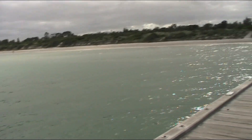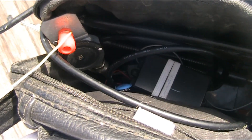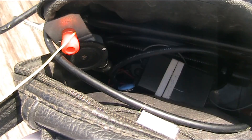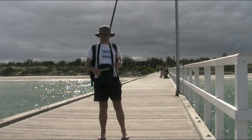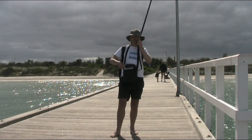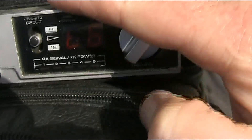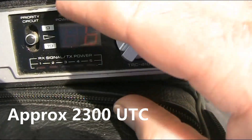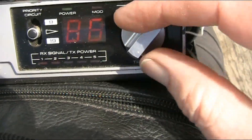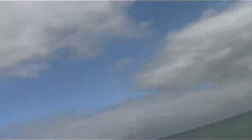So that's the test of a pedestrian mobile 27 MHz setup with an end-fed half-wave antenna, with a small matching unit at the bottom connecting right to the CB. I'm not using any ground radial at all, so it isn't dependent on you walking in the water or anything like that. Test number 9D, at the end of the pier — and getting good results here.